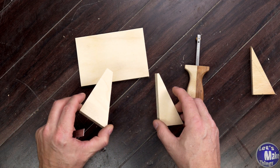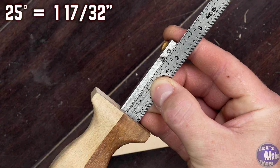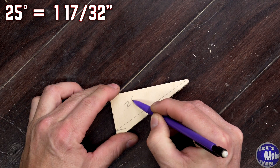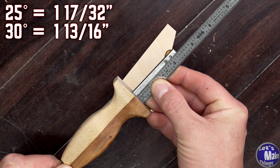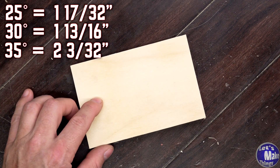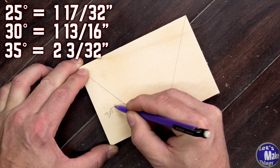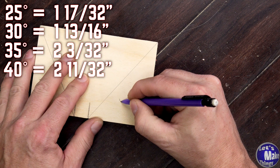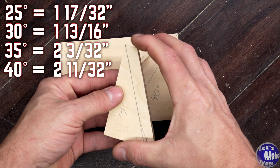Right now I'm going to show you how you can make these set pieces — it's very easy. We're going to go back to the original pieces that we cut off from the other piece and go to the smallest piece here. Just like before, we're going to go to 1 and 17/32nds and then add our mark, and this will give us a 25-degree set. Now in order to get a 30-degree set, we're going to set our marking gauge to 1 and 13/16ths. And this will give us our 30-degree set. For the last piece, we'll set this to 2 and 3/32nds of an inch. And if you wanted to go to a 40-degree bevel, you would go to 2 and 11/32nds. Those are the measurements you're going to need, again if you're using a 3 and 5/8 inch block.